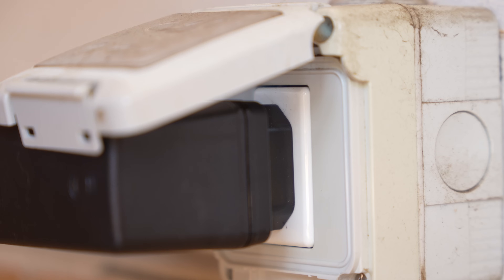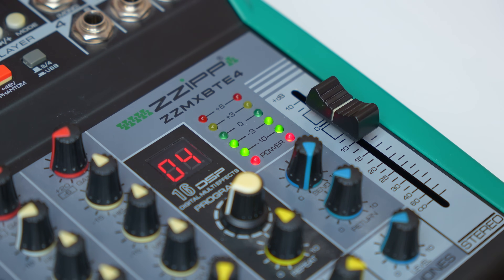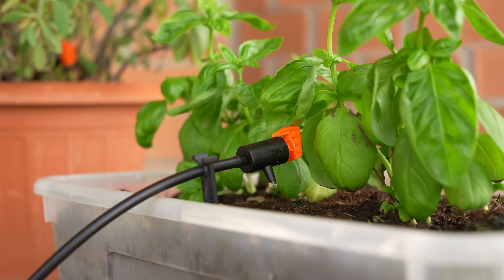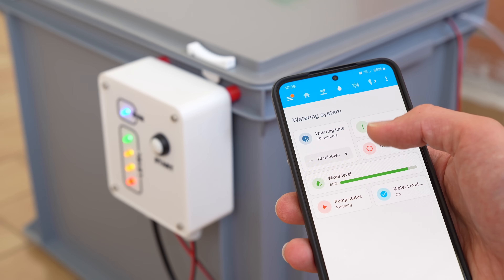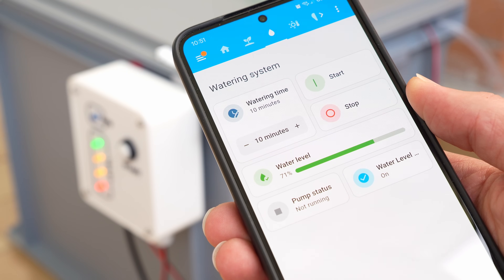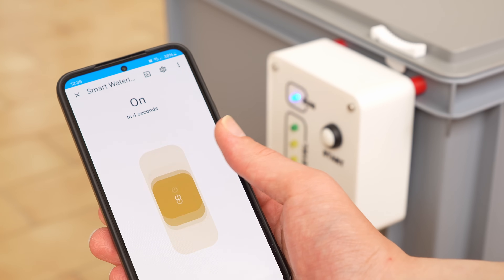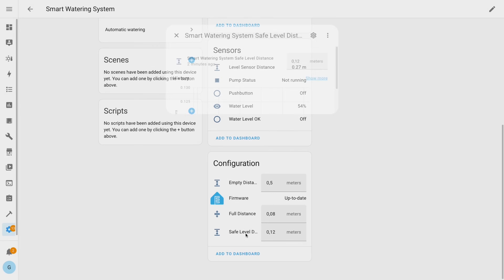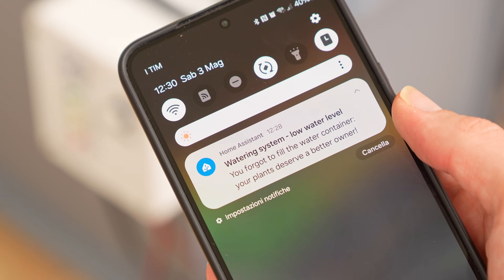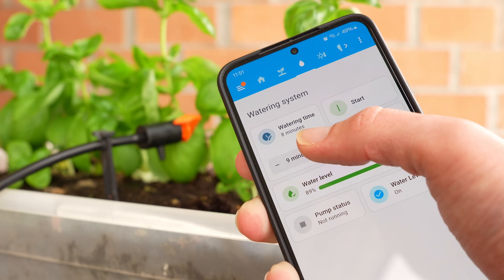It was finally time to plug in power. Immediately the LEDs on the panel lit up indicating the water level. On the Home Assistant app we can set a watering time — in this case 10 minutes — and press start. After 10 minutes the pump stops, but if we want to stop it earlier we can use the stop button. To start watering we can also press the button on the controller, and the time used will always be the time set in Home Assistant. The real game changer however is the ultrasonic sensor, which not only shows us the water level on the app, but also stops the pump if the water level is below a certain value that we can set from Home Assistant. The flashing blue LED indicates if the water level is too low, and with a simple automation we can also receive a notification on our mobile phone. Using automations we can also set a time at which to start watering, and to monitor the whole system I also created a dashboard in Home Assistant.